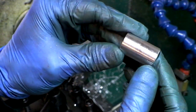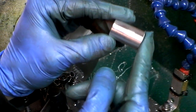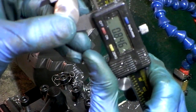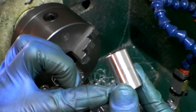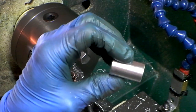You probably can't see it in the video, but right in the middle, when I was facing each side, I went to center line in the straight pass and then tapered outwards. And then the other side, I went to center line and then tapered outwards, so that the outside diameter here — only by about a thou — is 7.34. It's supposed to be 7.49 or something. And 7.36 in the middle, and 7.34 in there. That's just so that there's not a big lip, because when you re-chuck it on the other side, this chuck is not very rotationally concentric. So when you move the part, there's going to be a little lip where you flipped it, unless you do the taper trick. But it works great.